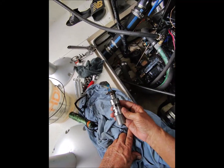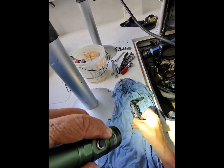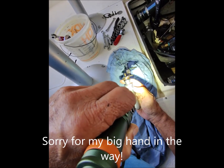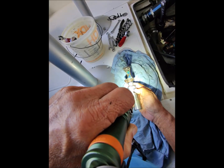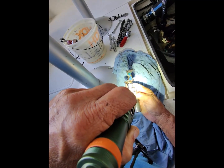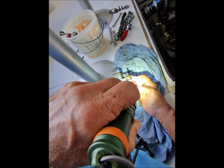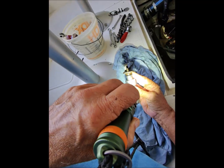My next thought is something mechanical. So, deeper examination of this valve. This boat is 30 years old, right? So I see wear marks on it. I don't feel any grooves. Again, this would be neutral here, and I would think if it's leaking to the forward clutches, it would be right here. That's kind of my theory, but it's hard to say, and I don't see anything major. Somebody with more experience is going to have to tell me, but none of this looks bad to me. If somebody sees something bad, let me know. But I'm not seeing it.